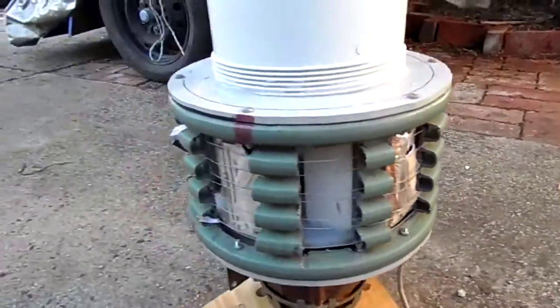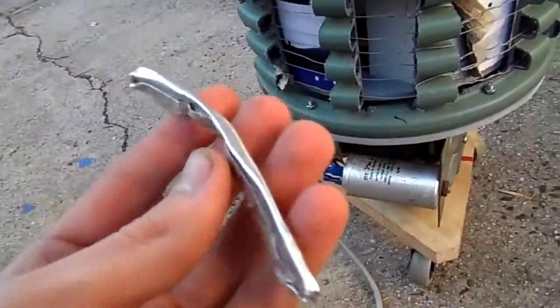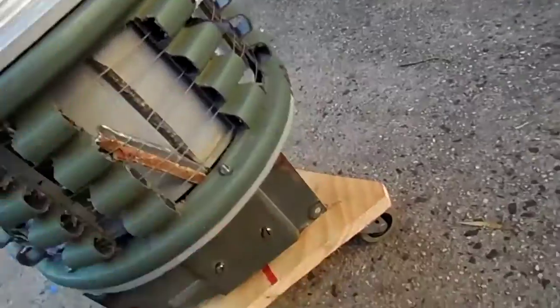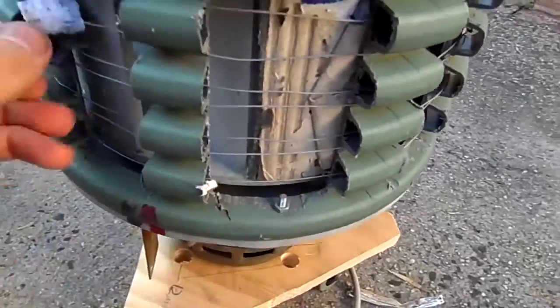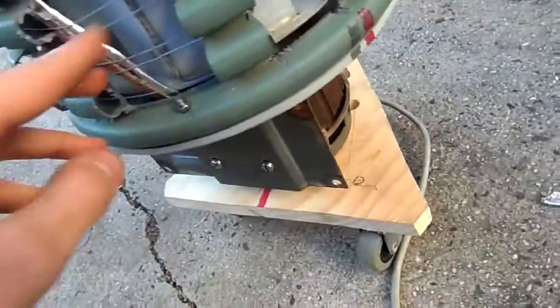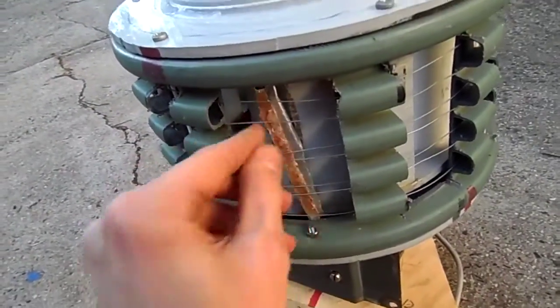Unfortunately that's the last power-up of this thing. I didn't get it on video, but as you can see it's self-destructed. The rotors are still good — the rotor fins haven't come off — but basically one of these aluminium fins glued onto the rotors to take up some of the clearance came off from the extreme speed. As it went round, it just took the rest of them off. You can see the cardboard's torn, a bit of tape. The good thing is the rotor looks okay, which is important. Hopefully I'll be able to recover this, but that's disappointing — put a lot of work into that.